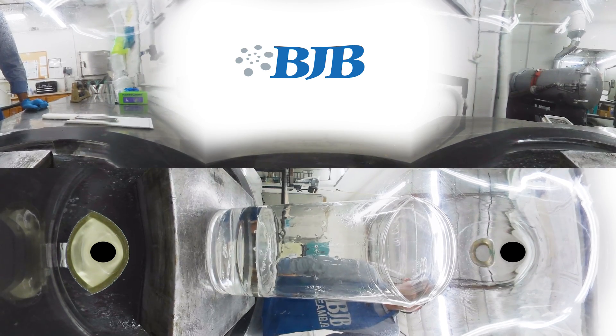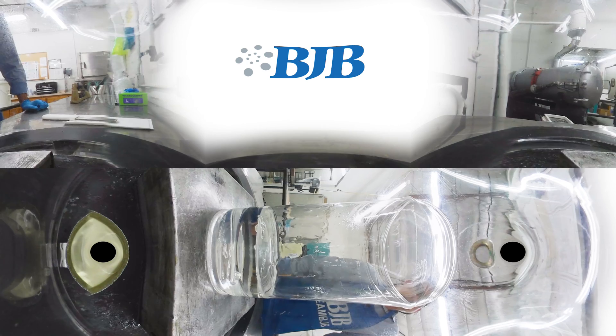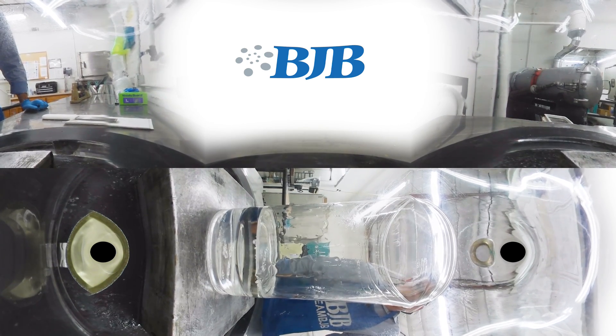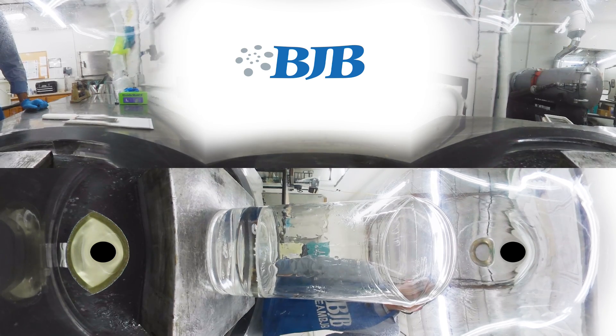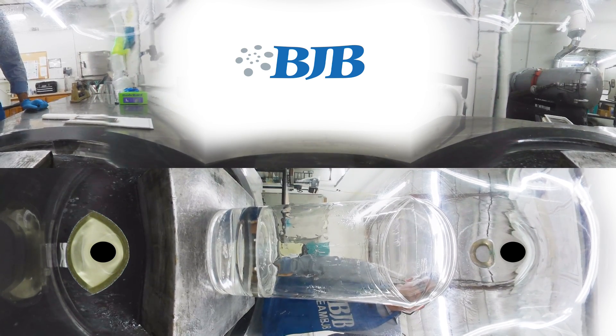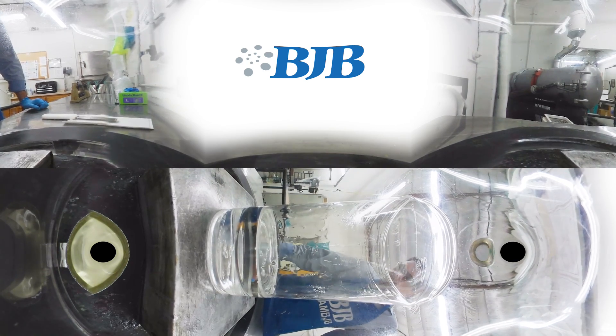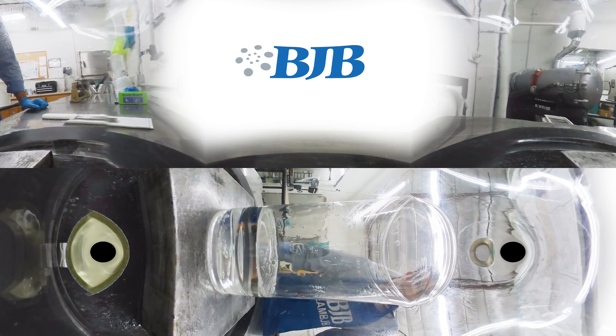It will continue to pull air bubbles from almost out of nothing. We won't pull vacuum until we see absolutely nothing, because then the material will eventually just go off and gel. We'll stop pulling vacuum when we realize the amount of air bubbles has stopped decreasing. That's looking pretty good right there — there are a few bubbles still popping, but it's literally pulling from the plastic cup. We're at about 29 inches of mercury.